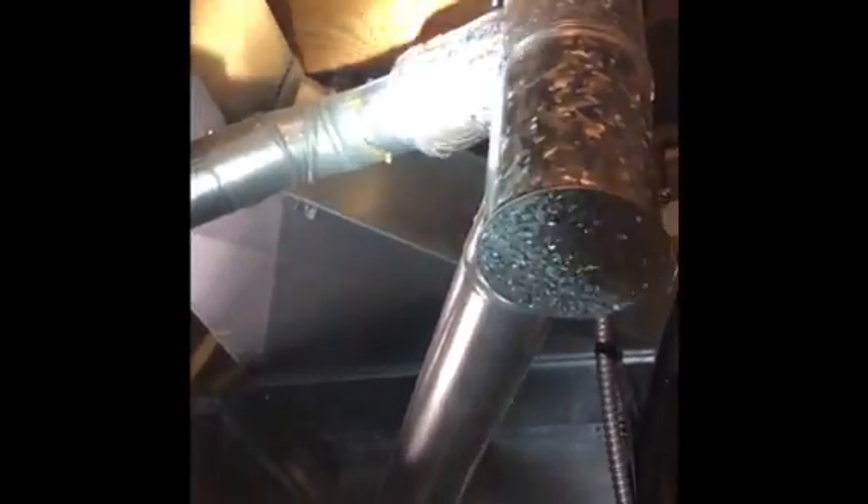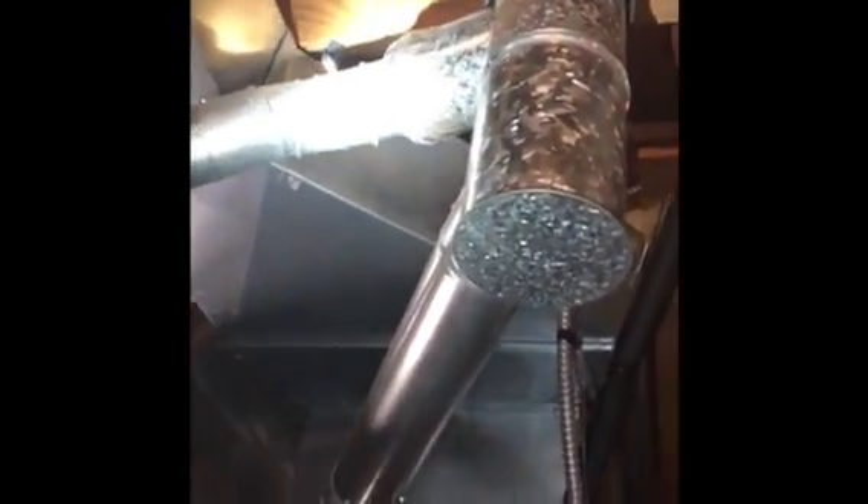Our flue pipe is code — it's four inch flue. It runs out of the top of the unit and up to our B vent and through the floor. There's a little bit of duct tape on this flue tee over here, so we'll change that out. We'll make sure that transition going into the flue tee is nice and tight.